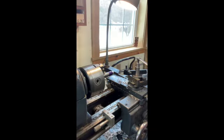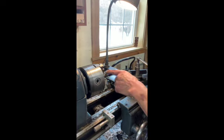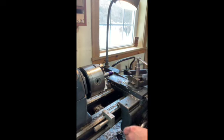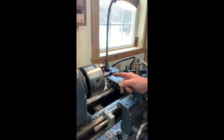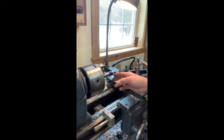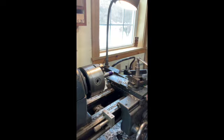I'm ready to make the infeed and outfeed rollers, so I've chucked a piece of 3/4 inch carbon steel into the lathe and put some layout blue on it so that we can see what we're doing. And you can probably see right here, I've set a stop so that I'm not guessing at that shoulder. This is not machine critical, of course. The tolerances are such that you could measure this with a ruler. So it's not real critical, but we want to be consistent so that when we're done, the shoulder is consistent.